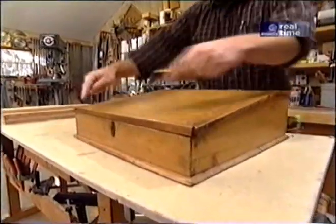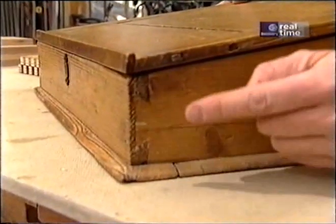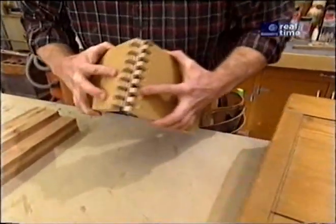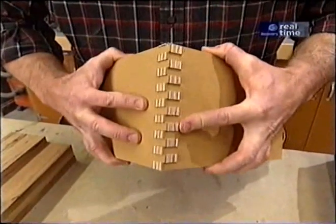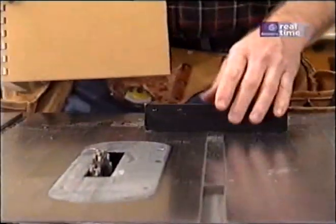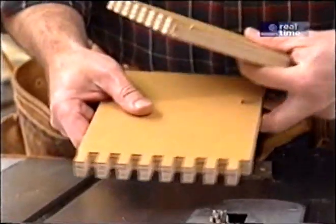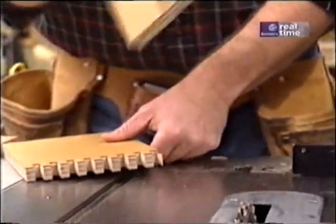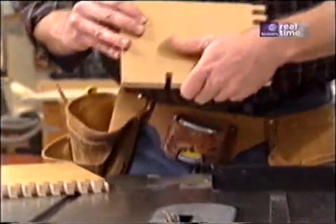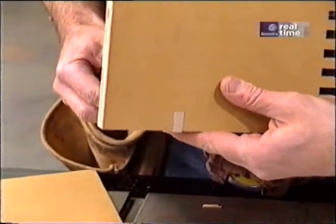The next step is to build the box of the writing case. On the antique original, they used a dovetail joint, and that's a very nice joint — I'll save it for the cherry case. For the chestnut case, I'm going to use a slightly different joint called a box joint. It's a very strong joint and it's very attractive. To make box joints at the table saw, you need your miter gauge and a dado head. I've set up the dado head for three-eighths of an inch width, which is the size of the pins on the box joint. Not too tight, not too loose — that's the key to this jig working properly.